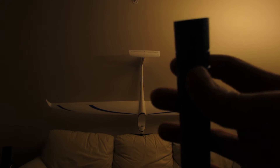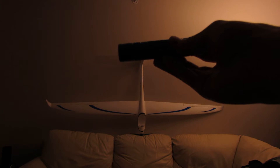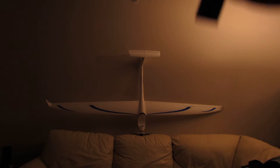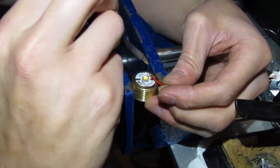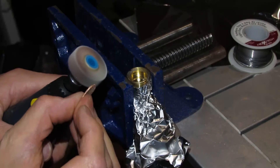After about a minute, this thing is basically too hot to hold. If you need a powerful flashlight, upgrade it to 16 times 7135s. Some may think it's not useful because it gets hot, but when you need a lot of power for a short amount of time, that comes in handy. And when you need very little power, it can still go on low and last a very long time. At 20 watts, it puts out as much light as a 100 watt incandescent light bulb — so that's pretty bright.